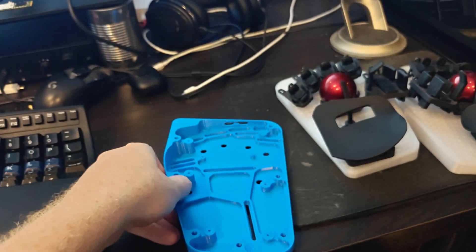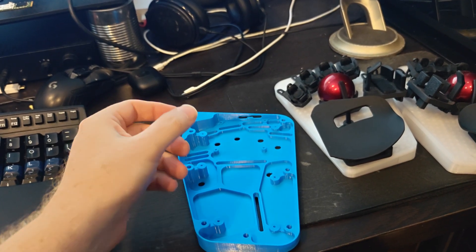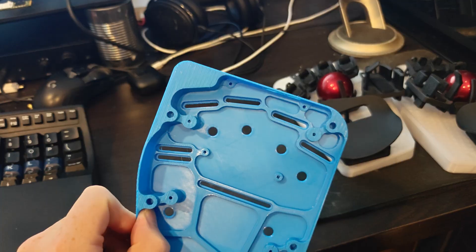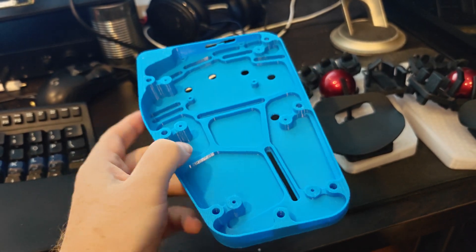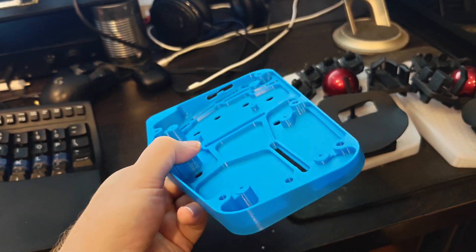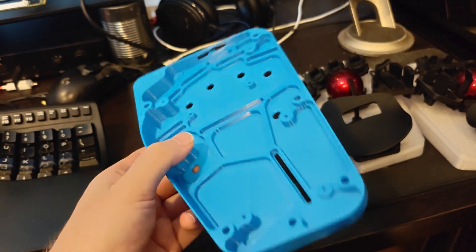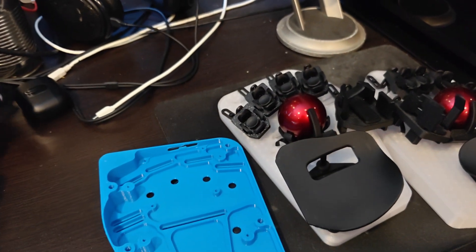The holes and threads all need to be machined at that angle. The acrylic piece will be machined flat — not on an angle — so there will be about a one-millimeter gap between the acrylic plate and the aluminum. Because the acrylic is clear you won't notice it, and it also allows dust to get blasted out, which is kind of useful.